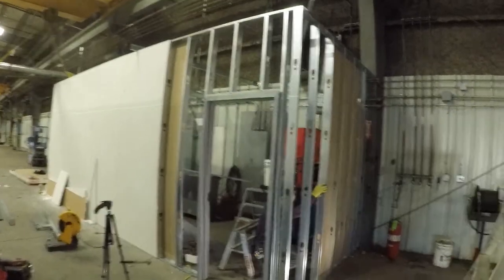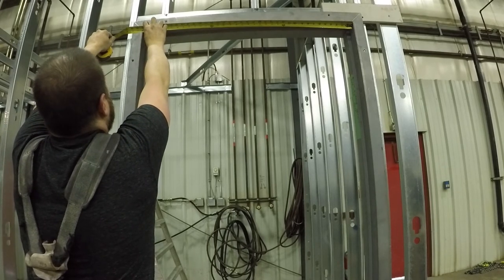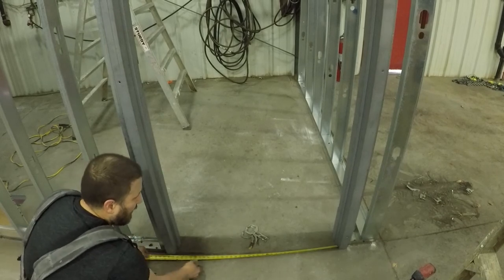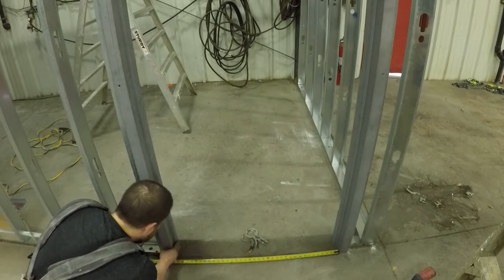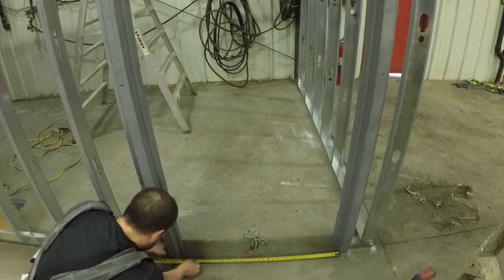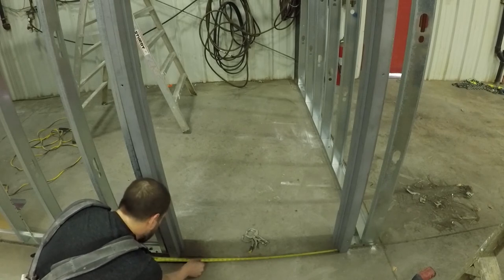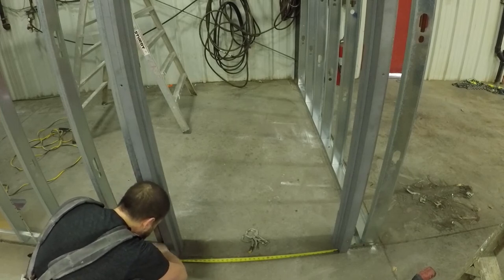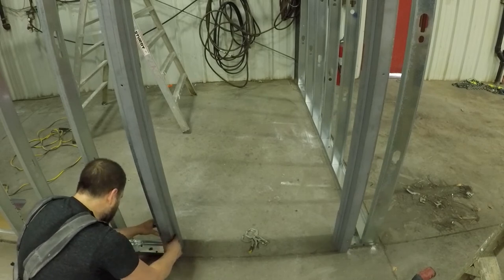I'm going to show you the second door here — same thing. I'm just measuring over, squaring over the bottom. On this side I use my framing square to square the door stud — I call them the hinge stud and the door stud; I don't know if that's right but that's how I know which side I'm working on. Always plumb up the hinge side and square over the bottom — that's the main thing. A lot of doors will come with spacers in the bottom that you have to grind off and cut properly; you don't want to hammer them off and make it all mangled. Always checking with my tape — it's better to double check, triple check. Clamp it and yeah, it's good to go.